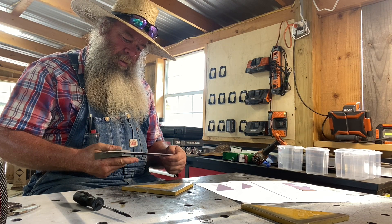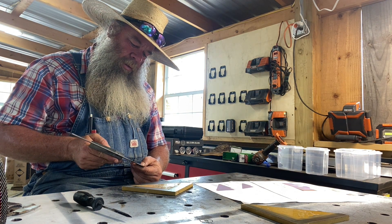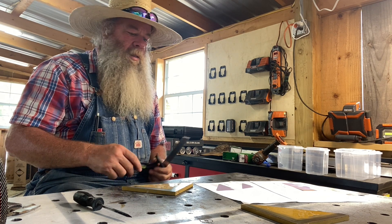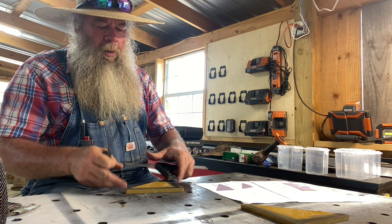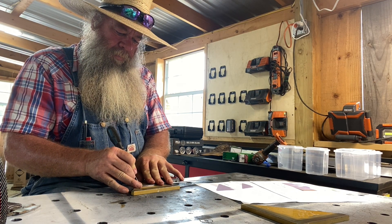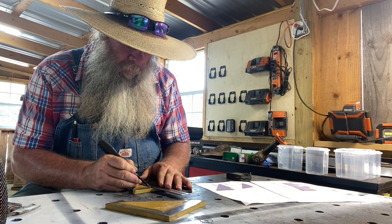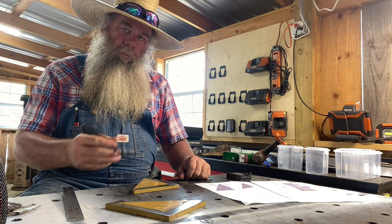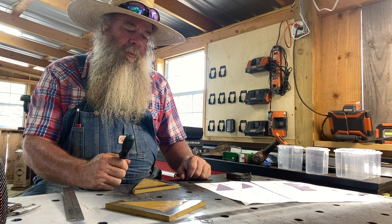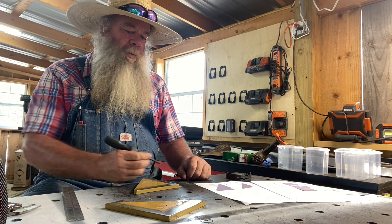I hear Mr. Frost barking over there — there's a dog next door. He wants to do a little socializing but he can't go over there because of his collar. So we could actually weld these in there and leave them, but they'd be sticking down and it just wouldn't look so good. So let's just drive a line here and cut it without doing any extra layout. We'll clamp this one down, burn it off with the torch, then take the grinder and clean it up. These things will actually be ready to weld on then.